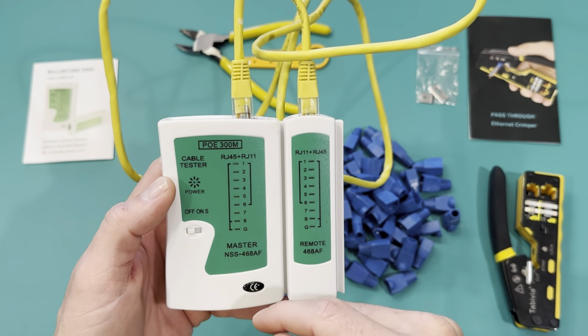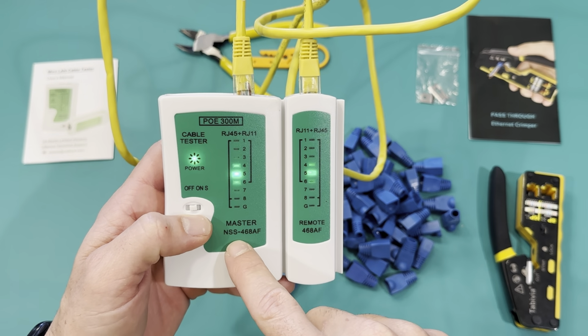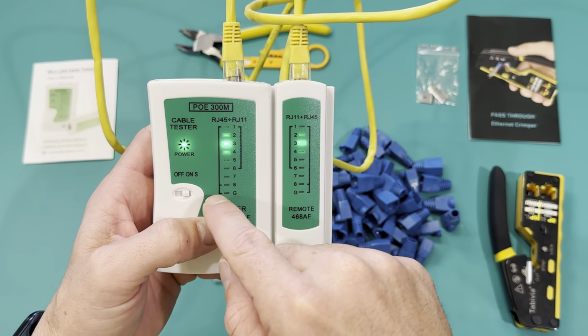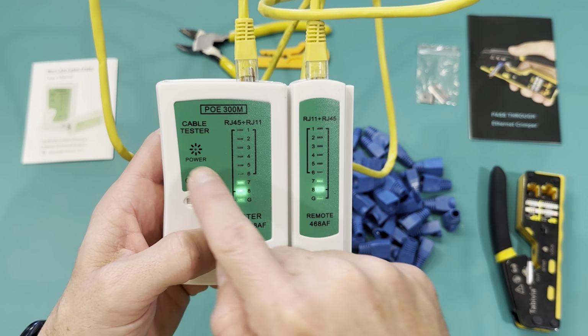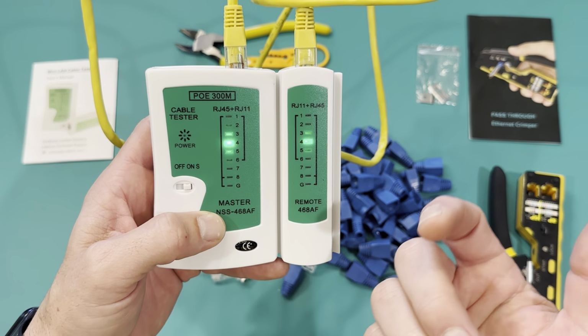First thing I'm going to do is test this wire, see where the fault is. So we should turn it on, and the on is going to go through a quick rundown, but if you put it in the slow mode, it'll slow down so you can see it. Oh, and you can see it's the first wire. So the first wire is not lighting up, and you'll see it'll go down, it'll blink, but nothing will happen. Then it goes automatically to 2. So the fault is in the first wire.